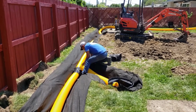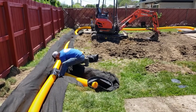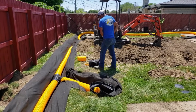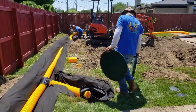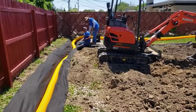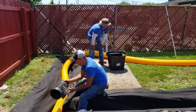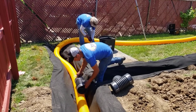It's going to take all that surface water that you've seen in those pictures. It's going to take in all that bulk water, and it's going to handle it just fine because it's a solid 6-inch pipe with four 20-inch round inlet basins. So this is one heck of a yard drain system. This is honestly commercial level here. I saw those pictures, and I saw just how bad things were, and the neighbors have all this concrete, non-permeable surfaces. I knew we were in trouble. We had to bump it from 4-inch to 6-inch just to get it done.